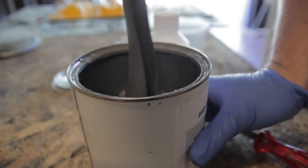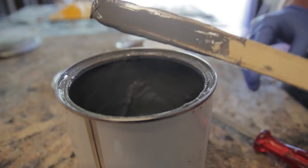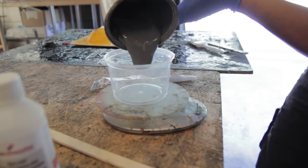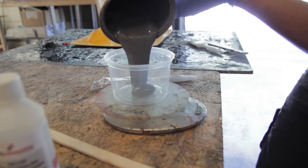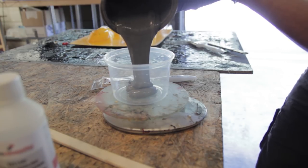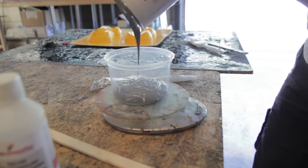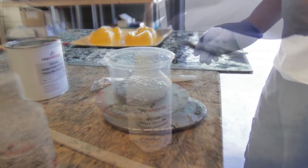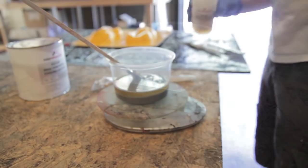When opening the can, first make sure to mix everything inside to avoid unmixed resin settling at the bottom. As you can see, the resin is very thixotropic — this is a gel coat with a gray color. I like gray on a mold because it makes it easy to see all the voids that don't yet have pre-preg coverage; a black mold would make this much more difficult.